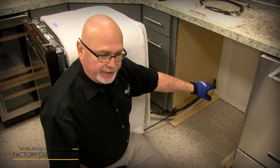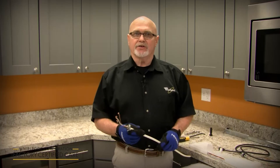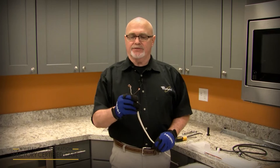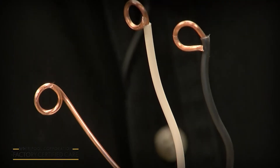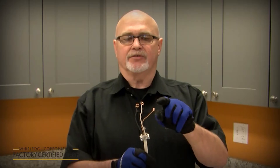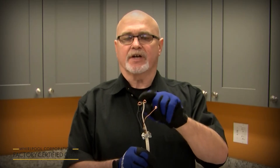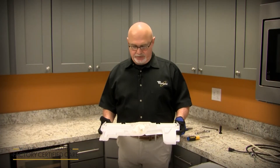For hard wire or direct wire using conduit, the hookup is basically the same: black to black, white to white, and green or bare wire to ground. Make sure you get the strain relief on it, then use needle-nose pliers to make a circle with the copper wire, put the terminal box screw through it, and you're all set.